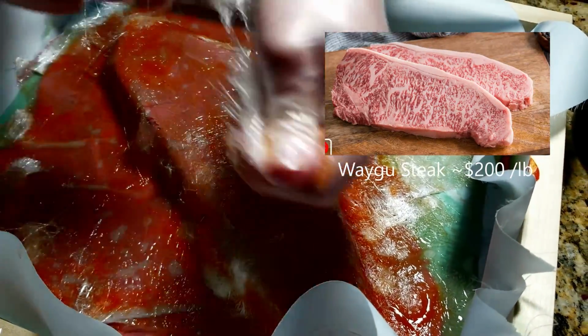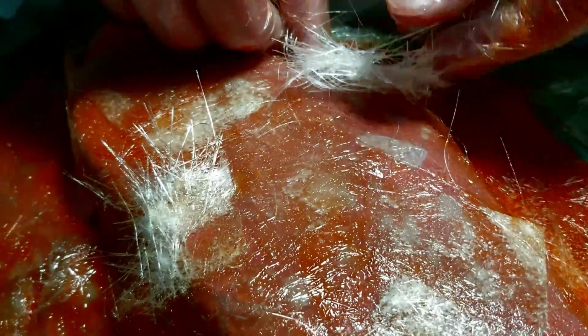That's true. So like you see how that texture is, like the sheen, right? In this area right there, that's really what we want. That's what I was gonna say. Like that sheen over on this far side. I'm gonna try to get between your hands. Yeah, right where he's putting it, it's a little wet. This part right here is nice, and you can still see the strands through the epoxy. That means that you got just the right amount.